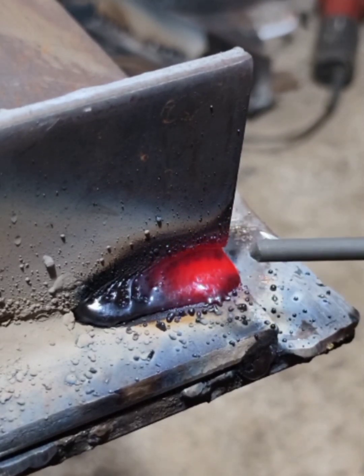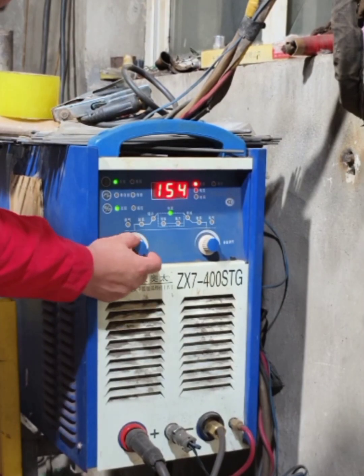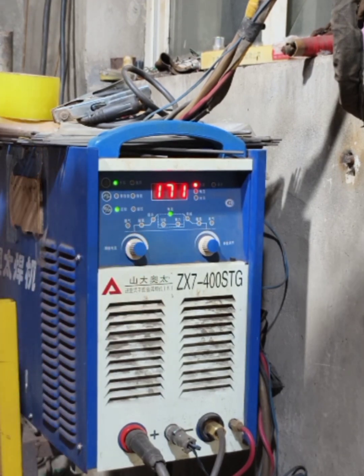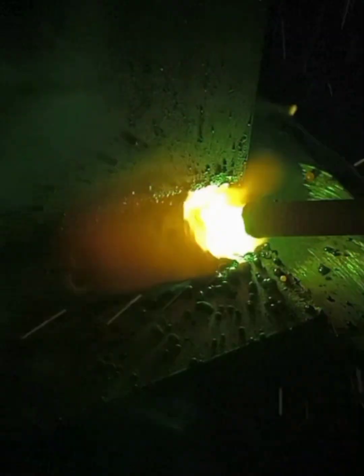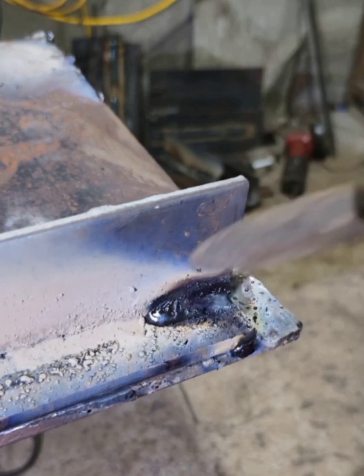The last and most fatal defect is undercutting. Some beginners, after hearing that flat fillet welding needs a large current, set the current very high. If the hand speed cannot keep up with a particularly large current, it is easy to bite the edge. Also, if the arc is too long during flat fillet welding with a large current, it will cause undercutting. When the electrode angle is greater than 45 degrees horizontally and the welding current is large, it will also cause edge biting. Edge bite defect is one of the most dangerous fatal defects in production — as long as there is a bite edge, it is zero points.